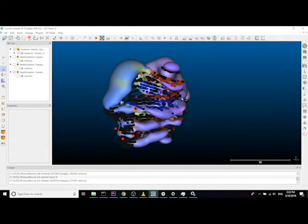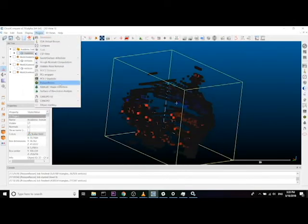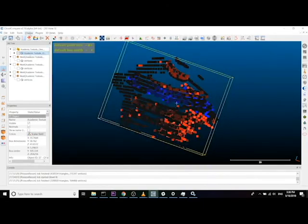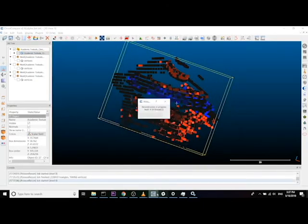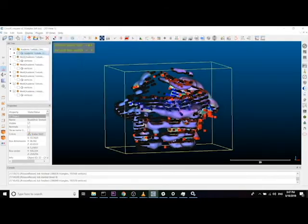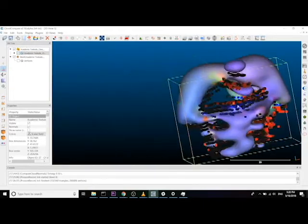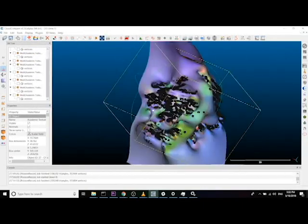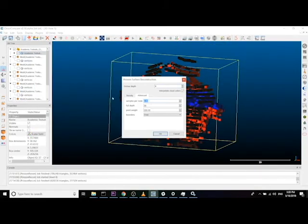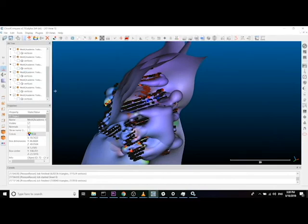Here we can see that when we generate the mesh, initially using just basic settings, it's quite globular. So we went in and toyed around with all the settings until it looked like we wanted it to look. So we got less globby, but we still see a lot of free-floating meshes that aren't continuous. And so what we want to do is reduce that by making it a little bit more globby. Using this different mesh format, we were able to have a sheet that was generated, which we later get rid of in MeshMixer.